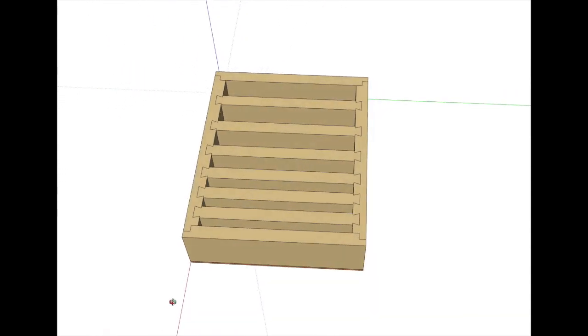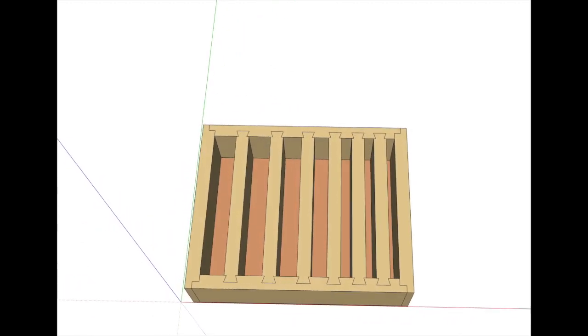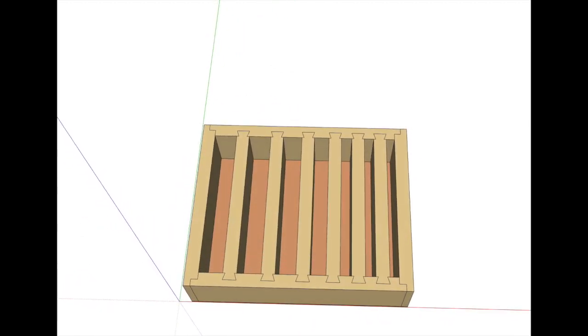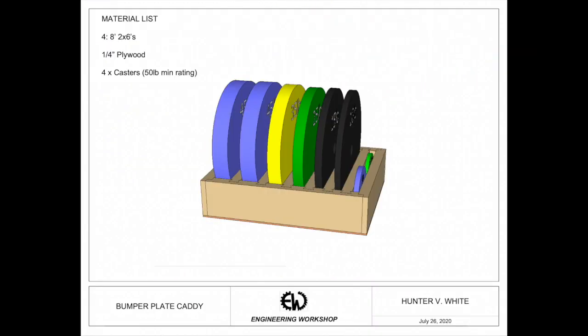This view shows the dovetails in the frame members and in the cross members, and I'm using rabbet joints on the end. Everything will be held together with glue, and the plywood is screwed in from the bottom. I used Layout to help make the build plans for this, and those will be available with a link in the description.